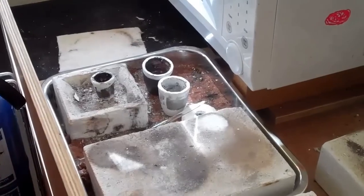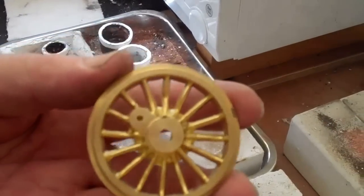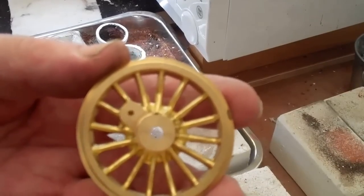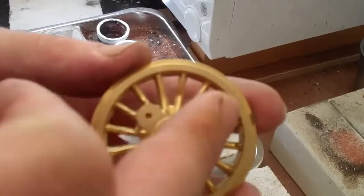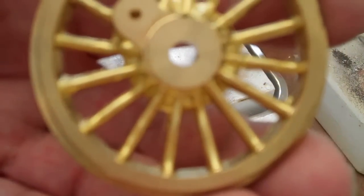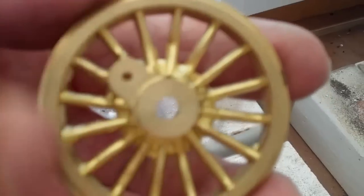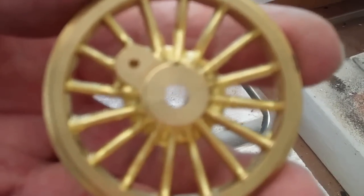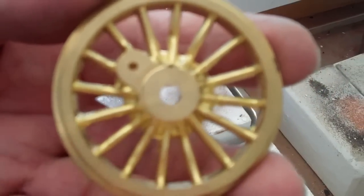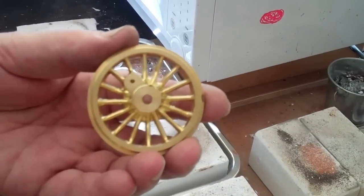When the job gets in need of much more venting, this loco wheel is a good example. You can perhaps see the meniscus on the top of the incoming metal is nice and smooth — it was well up to temperature, it was flowing well — but the air pressure in the bottom of the individual spoke moulds was holding this out from the proper shape, so we haven't got a full shape, although it's otherwise a good casting.